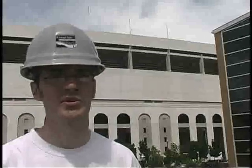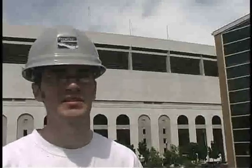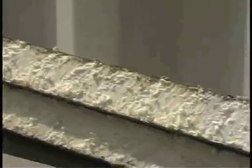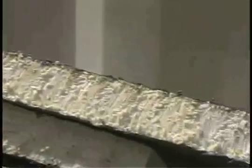A couple of disadvantages with traditional insulation: number one, you're using more material, and number two, it's not necessarily going to be as consistent. What's nice about this system — the rigid insulation — is that the R-value per inch is nearing probably twice the R-value in terms of efficiency. And also it's continuous across the roof, so you're not going to have breaks from roof joists or things like that. The R-value per inch is higher as well.